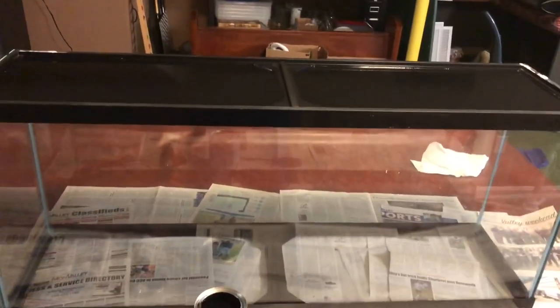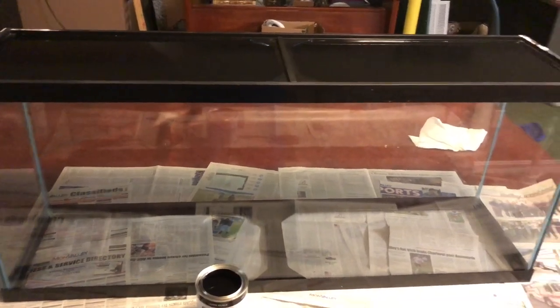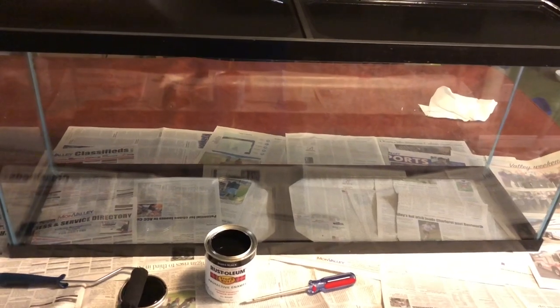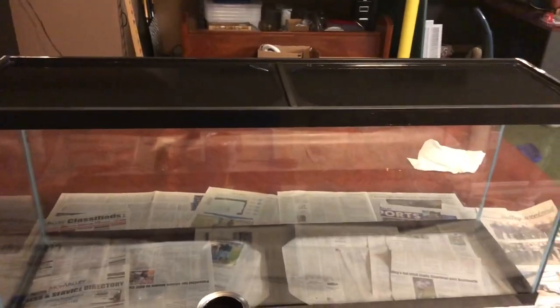You can see some spots are a little bit thinner — that's where the second coat going left to right is really going to fill everything in. I've got some fans running here to help it dry faster. Go around, push it into the seams, roll up and down, and get a good amount of paint on that brush every two to three strips. That barely put a dent in my can. I'll come back in an hour for the second coat and show you the final product.